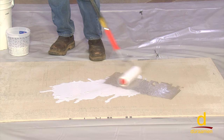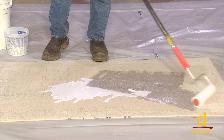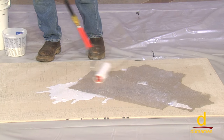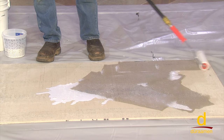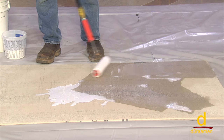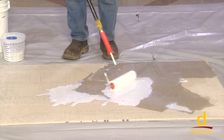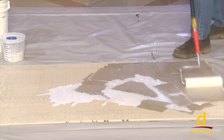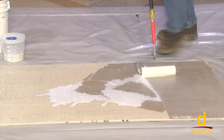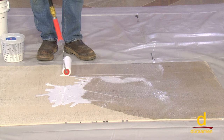The reason for priming is it serves two functions. One, it acts as an adhesive for the PARAM SSL to adhere to. But just as important, if not more important, is it seals the porosity of the concrete. If you don't prime properly, when you install the product it'll flash dry on you — and you don't want that. So it's really crucial that you get the appropriate amount down. You can see how fast this is absorbing in. If you prime it properly, it's going to give you the necessary time to install the product and, more importantly, to go back out and do a second troweling, which gives the look and feel of polished concrete. It's a very handcrafted, organic look when executed properly.